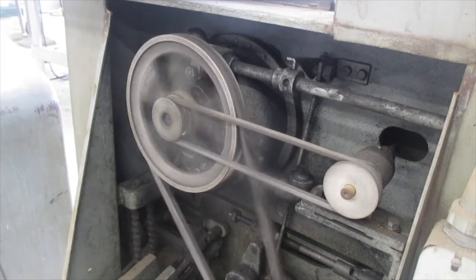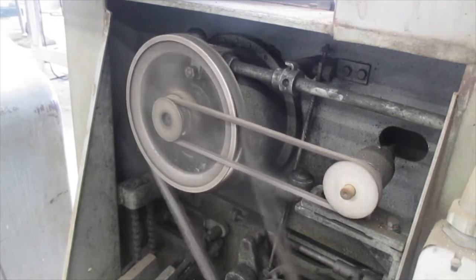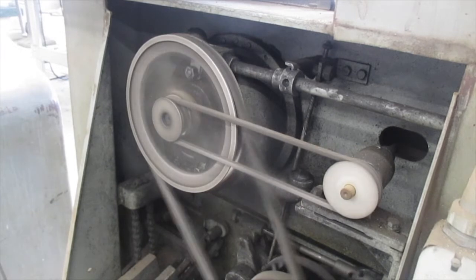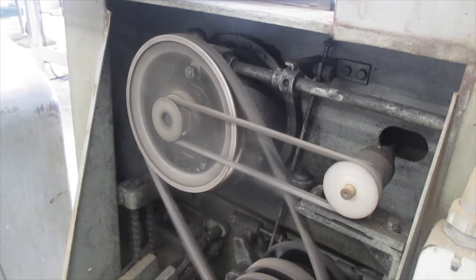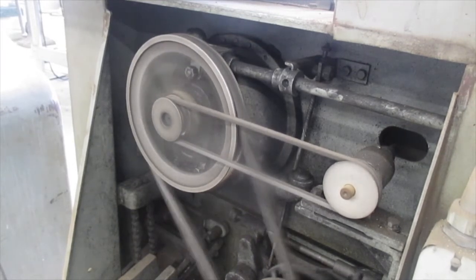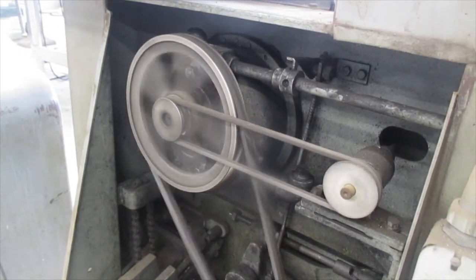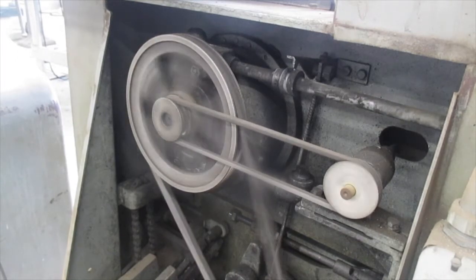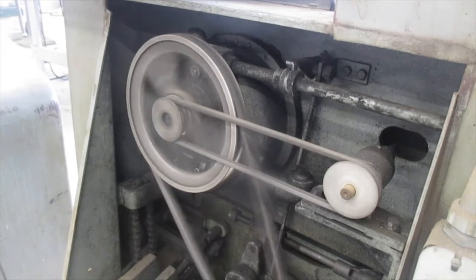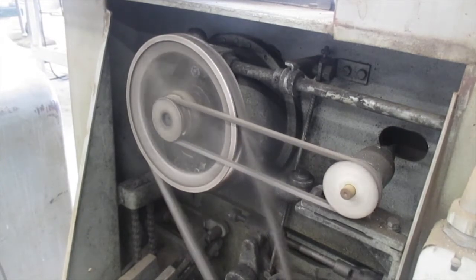You can also see the detent locking mechanism. When you turn the speed selector to the lowest speed, it lifts that detent lock and allows you to change from high or low gears on the transmission. I'm trying to imagine how the selector fork became so bent. The only thing I can theorize is that possibly someone had tried to shift the gears when it wasn't running. This transmission needs to be running in slow speed when changing gears — it has to be running to do that successfully.